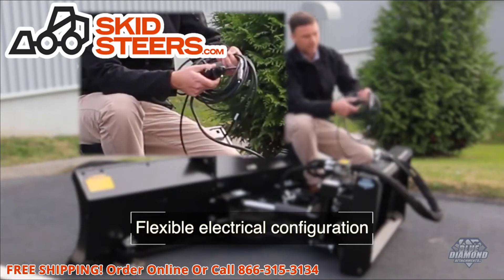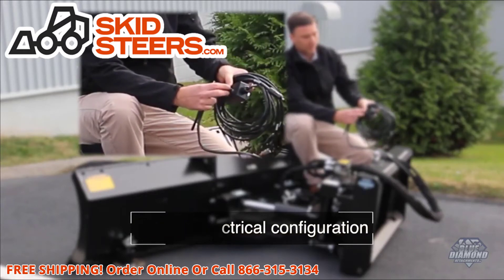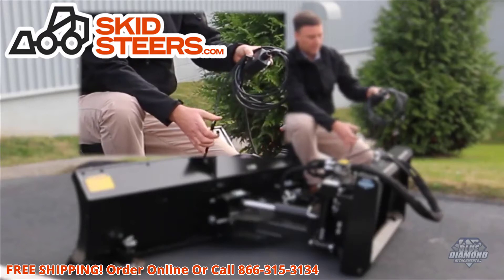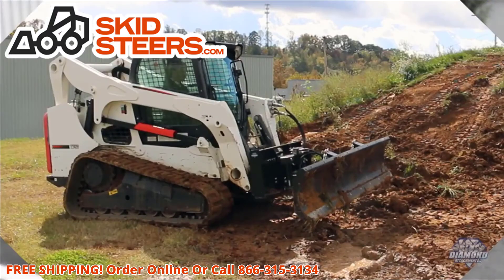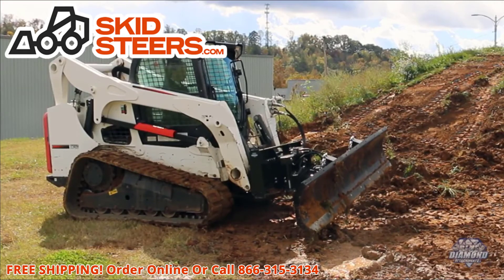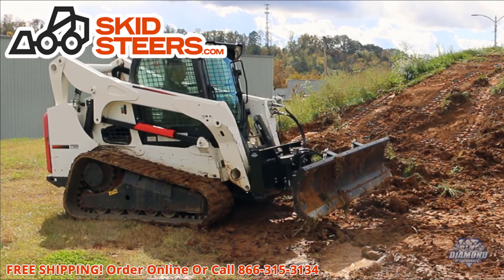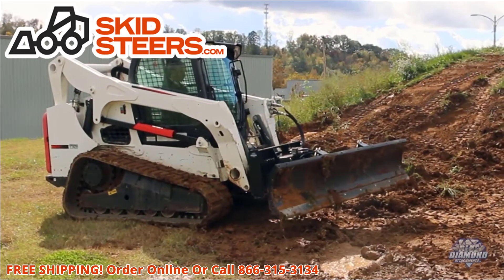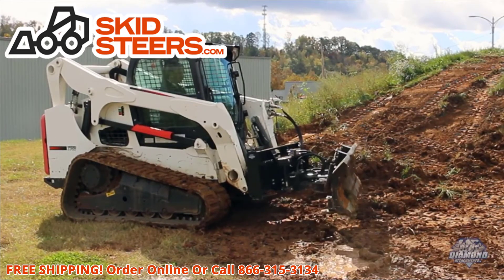We have this magnetic box and it's just a simple flip switch. The dedicated flow is going to go directly to your tilt, being that it's the most often used function. And then when you flip your switch or hit your pin control in your machine, it'll switch to angle. Very simple system, very reliable, and very functional.